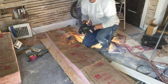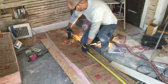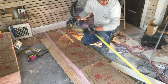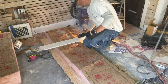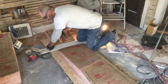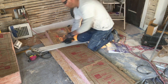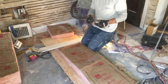If you're ever cutting bat insulation, here are a couple of tricks. I'm going to measure this out — I need to cut this at 99 inches. The easiest way to cut it is to lay down a piece of 1-by and press the fiberglass down. Then with a really sharp blade — you have to have a sharp blade for this, if it starts to wear out get a new one — you press it down and you'll get a perfect cut every single time.